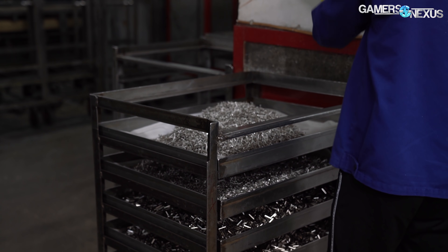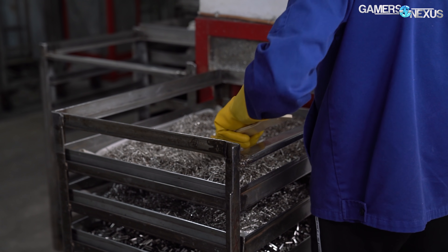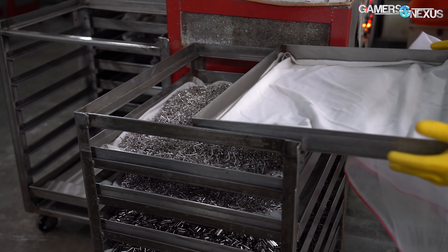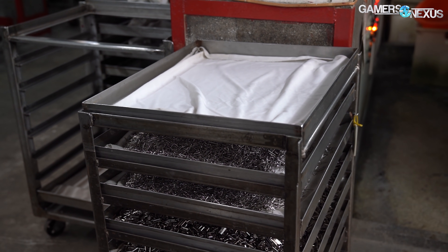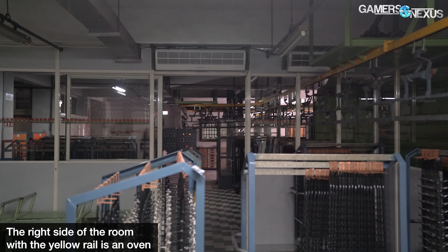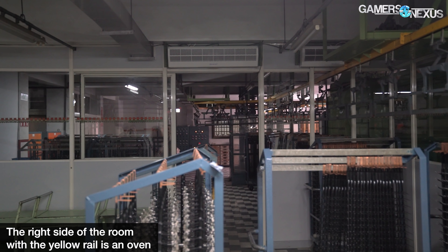The net is emptied out onto a tray and raked out for visual inspection. For customers who require a coating to be more decorative than functional, like Lian Li, the company can simply replate the parts to cover up any flaws. For small components with tight functional tolerances, flaws in the plating require stripping the existing plate and redoing the whole process — nobody wants flawed coatings on cold plates, seat belt buckles, or scuba gear. The factory also offers an extra touch for some components like seat belt buckles: these are baked in ovens on the second floor to give them extra strength against shearing force.